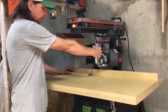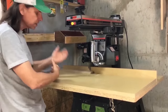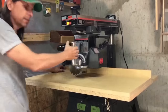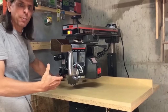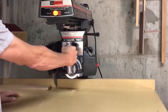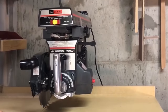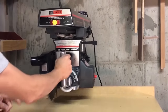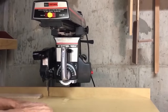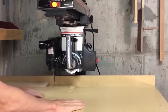If you're doing a pull-through cut and the saw tries to climb up on the wood, or grabs into the wood or the table, you've got to be ready for it to run back towards you — to be propelled towards you. Likewise, if you let go of the handle while the saw is turned on, it can propel itself out. As such, you never want to have your hands anywhere near the path this blade travels.